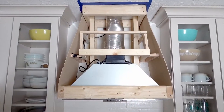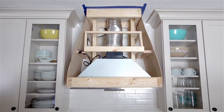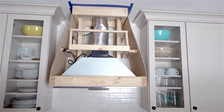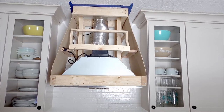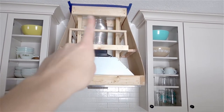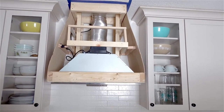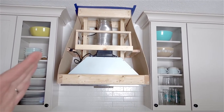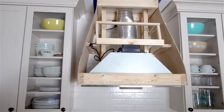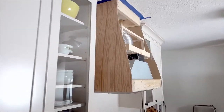All of the measurements and the process has been trial and error, so it's worked for us and it looks beautiful. I had to take off the front panel just to show you what we were working with. Basically we have a two-by-four structure — two rectangle pieces on the top and the bottom, and those were the main anchor points to this hood. The top piece is 20 inches long, and the bottom piece was 29 inches long by 21 inches deep. We wanted a nice taper on the side, sloping up, and from the side view it's sloped as well, so we have a nice little arch all the way around.